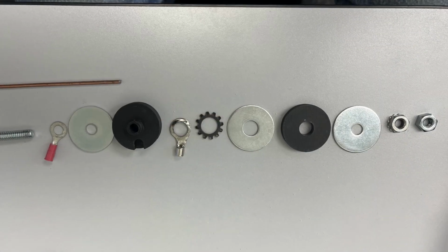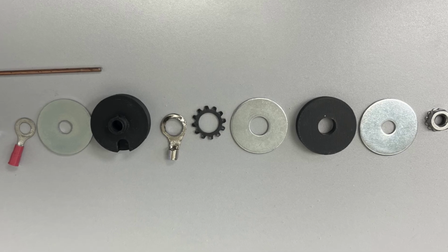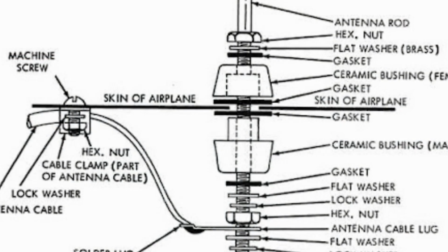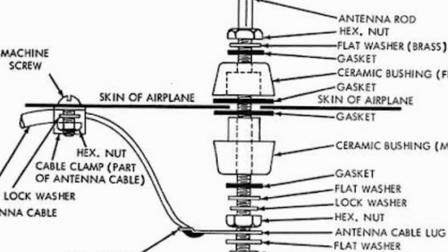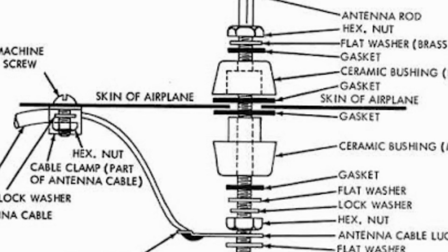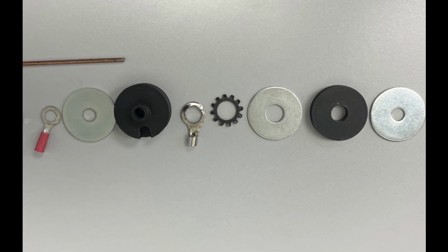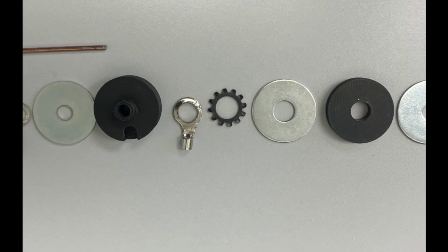I went to Fusion and drew out and 3D printed the needed isolator washers. We need the antenna whisker/bolt to not ever touch the fuselage or ground plane. Since I was planning to use 1/4 inch and 3/8 inch fender washers as support, I made the plastic washers with the same internal and outside diameters. And yes, I'll be happy to share these files.